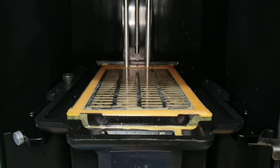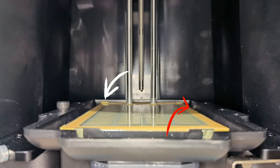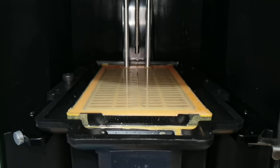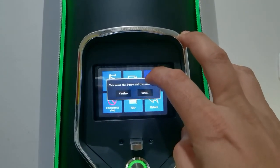I would suggest leveling your printer using the build plate as indicator, because the resin tank itself might not be level. You can see the back of my tank where the resin is lower than the front edge, but the resin is level on the plate. Lower the plate until there's a thin flat layer of resin on the plate and set that as your new zero height. The benefit is easier removal from the plate.